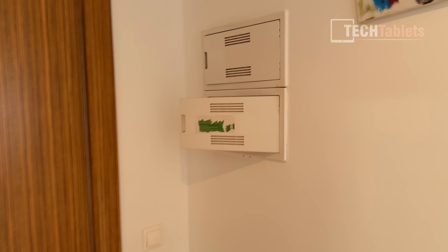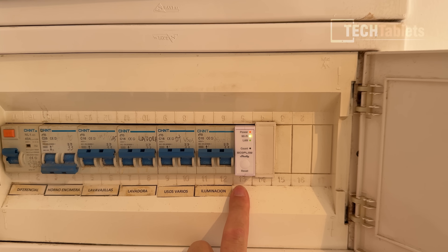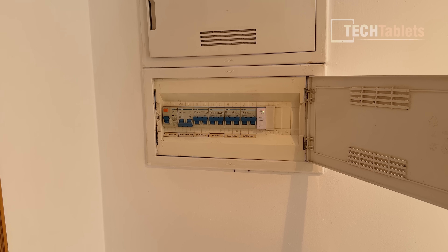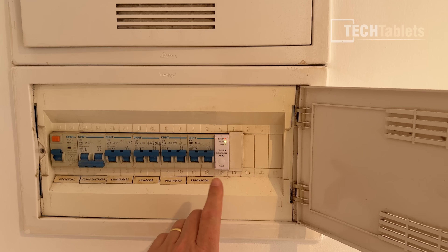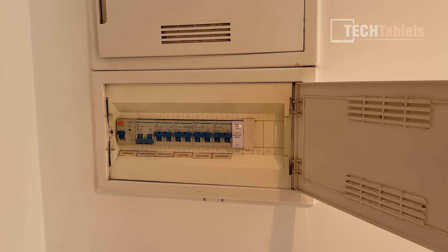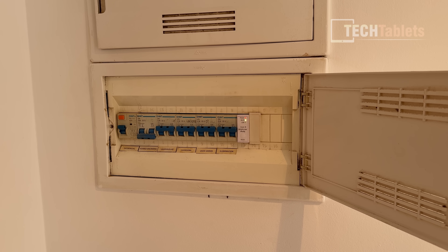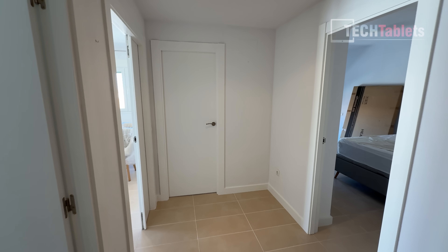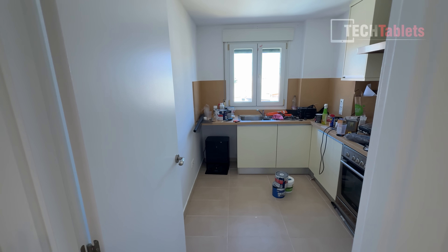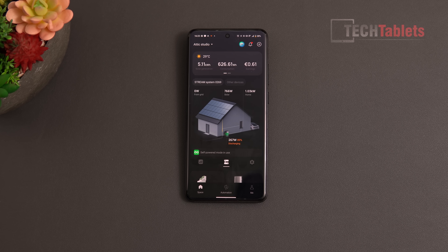Now for the smart meter — the EcoFlow Shelly smart meter. I had to get an electrician to install it in the circuit breaker panel. What it does is scale the output into the grid from the AC Pro and Ultra to match the real-time demand of the house, with zero feed into the grid so no wasted energy. Before, I was just outputting up to 800 watts continuously, but with the smart meter it scales that — if the house is only using 30 watts, that's all it outputs. This has really improved the efficiency.